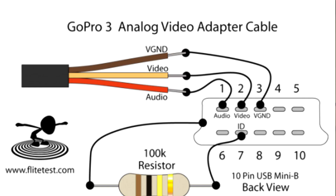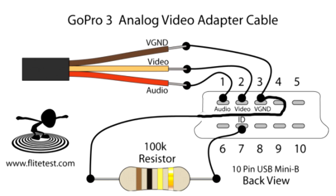Here is the diagram that I actually borrowed from the Flight Test guys from FlightTest.com. Just to show how I changed it a little bit — instead of attaching to the casing, I've attached to the ground, and just found that a little neater. Plus the fact I had a really, really hard time soldering to the metal casing since I believe it's stainless steel — it just wouldn't grab. So thanks to the guys from Flight Test.